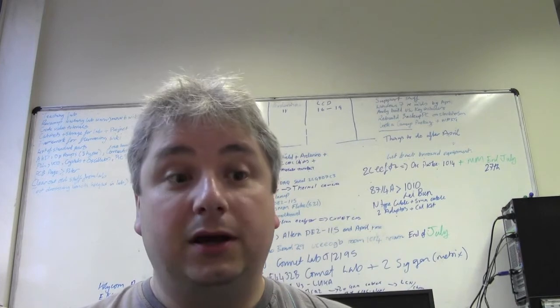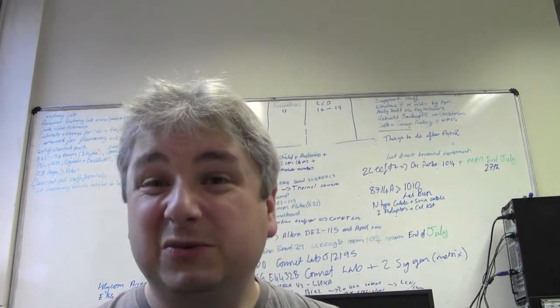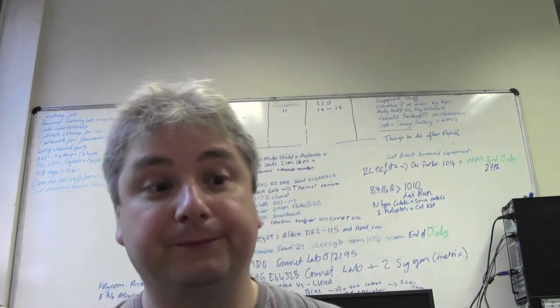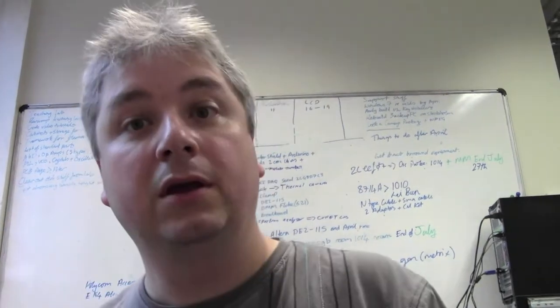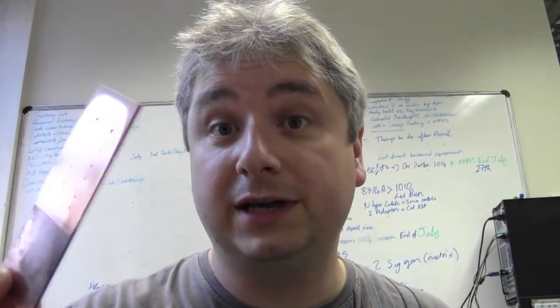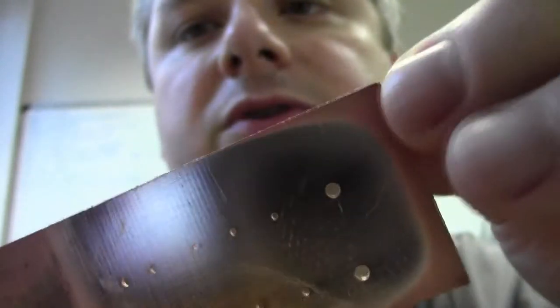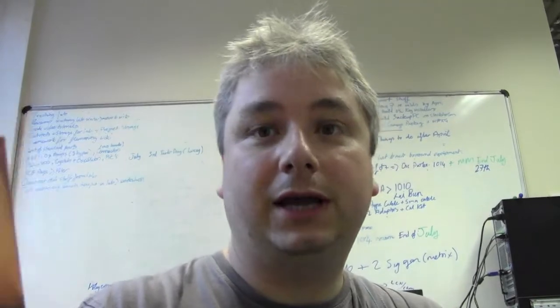Done. Right then, that's been about 15 minutes now. Let's give it 10 minutes more, and I'll go check to see how the board's going. Back in a moment. Right, it's been about 20 minutes, not exactly half hour, but good enough to show you what's happened in the process. As you can see, if I angle this slightly, my holes now have plating, you can see it on the large ones more clearly. Now, as you can see around the edge, there's a discoloration. This one's matte, this is quite glossy. The reason for that is I'm running out of copper bright in my electrolyte solution.